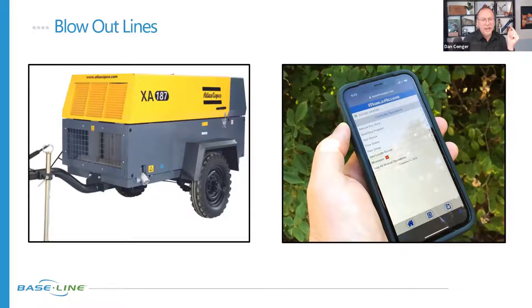Your air supply source — connect that after the backflow preventer or backflow prevention device, but before that first valve. Not through the RP or dual check — not through that device. We don't want to damage the device, and those ports are just way too small. Then you're going to activate that first zone, then turn on the air compressor. We don't want to compress any air, so the valve's already open and the zone's active before we start feeding air through there.